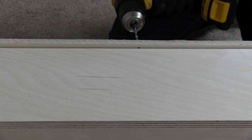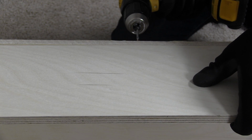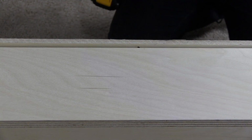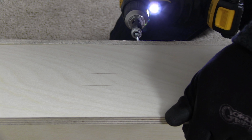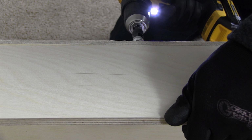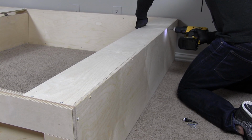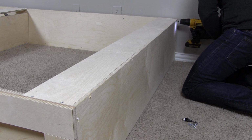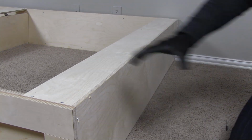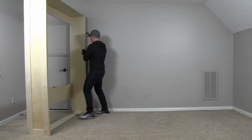The last step is to attach the cabinet top to this top brace here. I'm in the middle hole of the cabinet top, holding everything together, lining it up while I carefully create a pilot hole into the top brace, and then put one screw in so everything stays well lined up while I go back for my 4 remaining pilot holes and screws through the cabinet top into the upper brace. And then you're ready to stand it up against the wall.